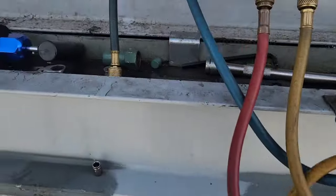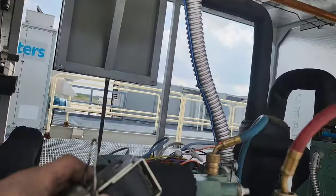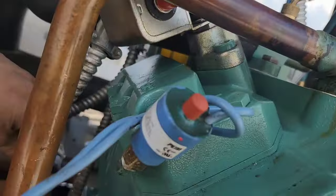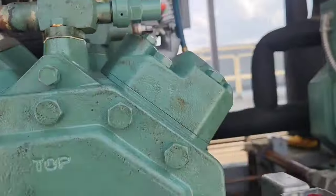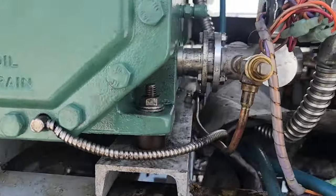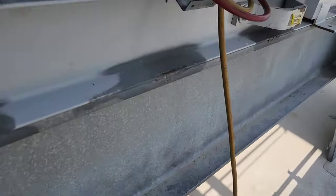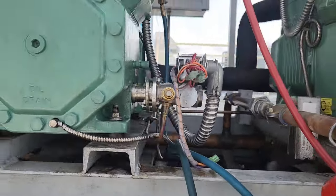I've been pulling the vacuum on it for like the last hour. Here's our unloader right there. I already pressure tested this thing and it held pressure good — no issues there. This has just been a great install, a great swap out. But I guess it doesn't make any sense to be pulling a vacuum on it if I've still got to swap this out — that's a jackass move on my part.